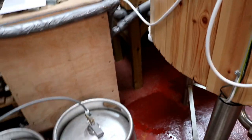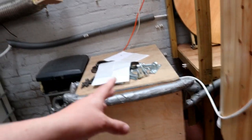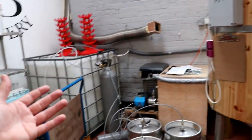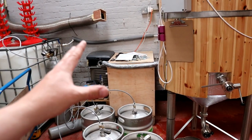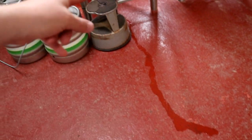I just spotted a little bit of water down on the floor — not sure where that's come from. Perhaps it's from the thawing of the chiller unit, because on Friday we emptied all the tanks and didn't need the glycol chiller on. When it rises above freezing any ice crystals on the outside of the tank will of course melt, leaving a little condensation trail. I don't think it's anything to worry about — certainly not a glycol leak, because there would be much more than that.